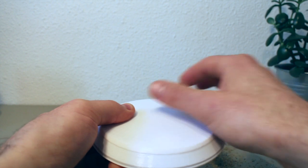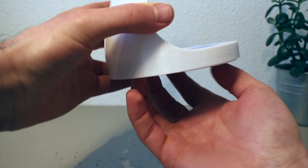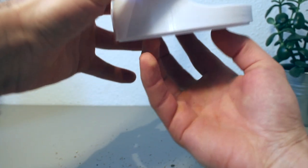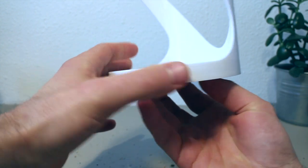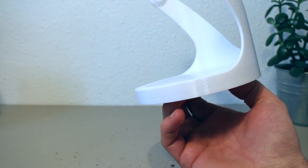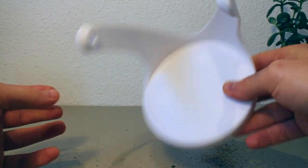This will seal up the hollow enclosure here, and then you just insert it into the bottom of the base like this, and use the cutouts, these holes here, to screw it with your fingers like that. And like I said, this is designed for 3D printing, so the threads, they are quite loose and fit very easily. And also the threads themselves, they have no overhangs, so everything is just perfect to print without using supports.